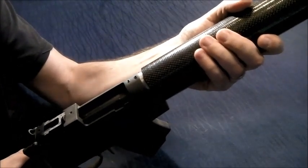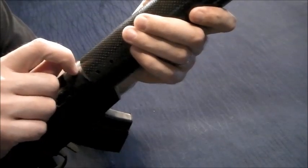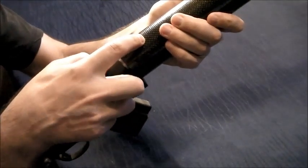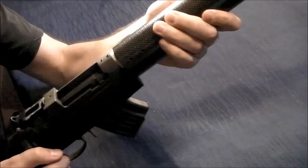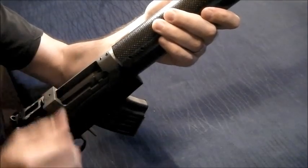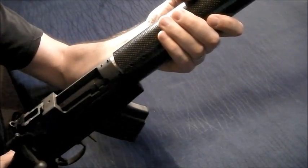Then moving forward is where it gets interesting. Now the original barrels on these, great idea, they weren't provided with a shoulder to breech them up. How they were made was that the thread on the barrel was rather longer and they had a breeching up nut here. Interesting manufacturing shortcut, interesting idea. The idea being that you take the barrel, you screw it up loosely, you put a headspace gauge in, you nip it down onto the headspace gauge, and then you tighten the barrel nut. Job jobbed.